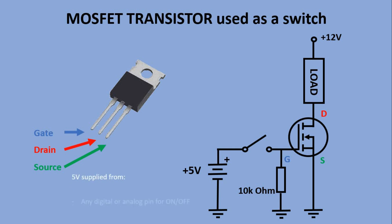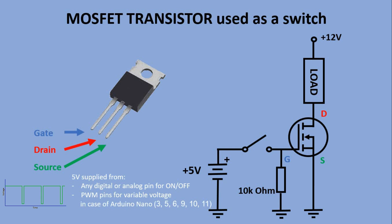Here we can have on-off logic, sending either a high signal (5V) or low signal (0V). We also have the possibility of using PWM — pulse width modulation. The pin we connect the gate signal to is Arduino digital pin 3, 5, 6, 9, 10, or 11. In this case, we pass a value to the pin with the analogWrite command — a value from 0 to 255. For 255 we request a 100% duty cycle, always on. For 127, it would be a 50% duty cycle, on for half of the time. 0 is a 0% duty cycle, always off. This way we can not only turn the LED on or off, but also dim the LED. We will have an example for it later in this video.